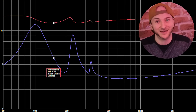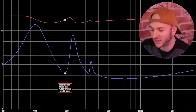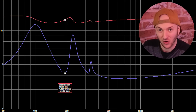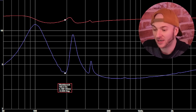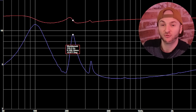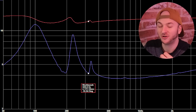The impedance valley is down at 187-190 Hz — it's a little wobbly down there, could be reflections in the box. But this enclosure is holding that cone dead still. We've got 4.2 ohms — very low — at 190, and we do actually play 198, so that's going to be very loaded and I'm expecting it to get pretty loud. From there, there's a sharp incline to another impedance peak up at 227 Hz — up at 9.1 ohms, still relatively substantial. The cone's going to be doing most of the air displacement at that point.